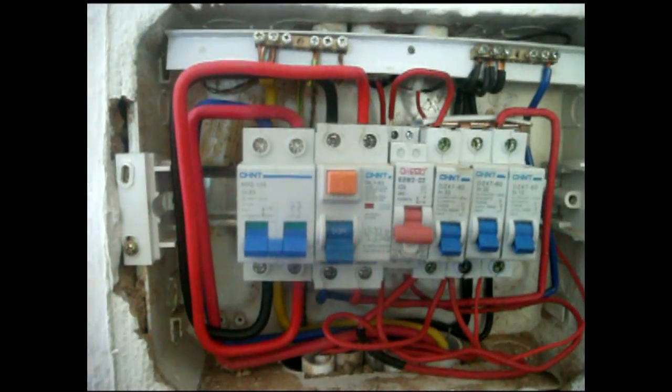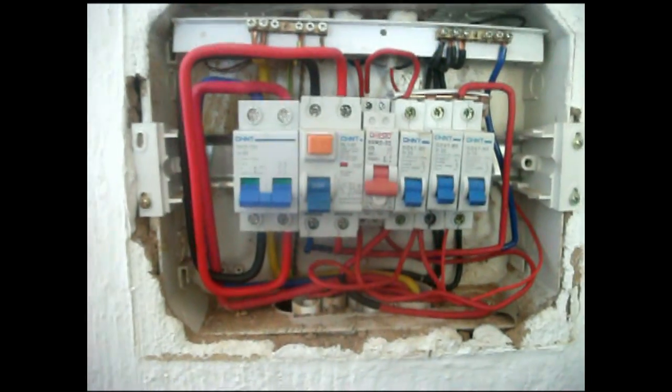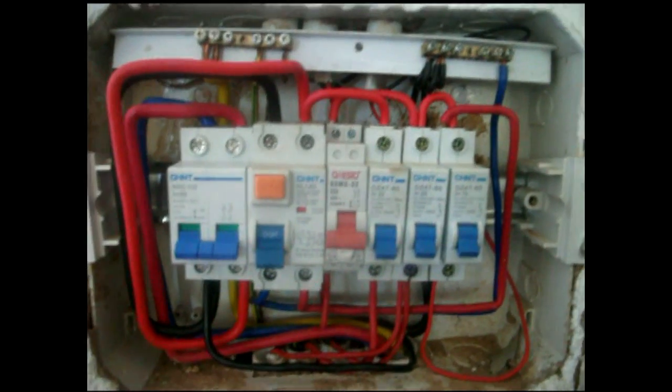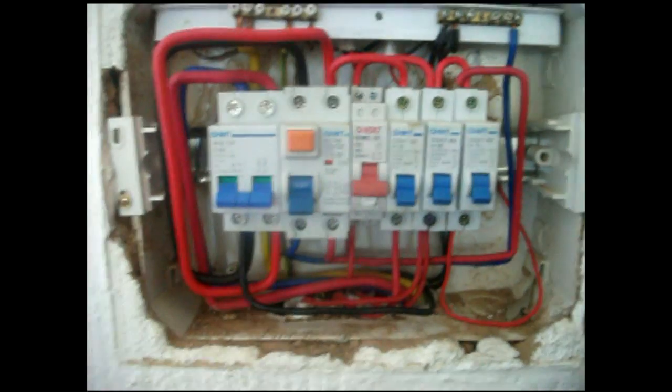Okay, the main breaker is installed, so now it's just a matter of taking the stove off the earth leakage and just tidying up the DB. Install the main breaker also — just remember when you take the circuit breaker off the earth leakage, you have to take off the live plus the neutral has to be off the earth leakage. Now we're just going to do it.